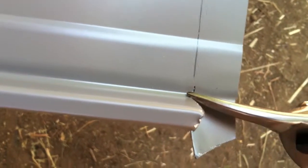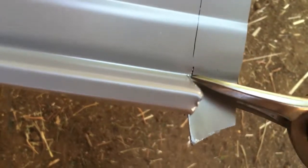This cut isn't particularly pretty, but you can see that it's offset by about an eighth of an inch as I come across the top. I cut it at an angle going across to meet my three-quarter inch mark, and then I'm going to leave a little tab right here that I can then bend up - it will follow the contour of the rib right there, just to make it a little more sealed.